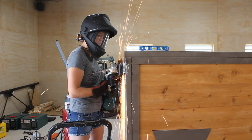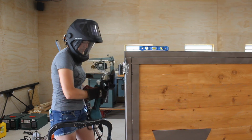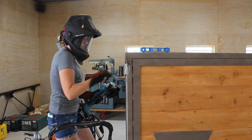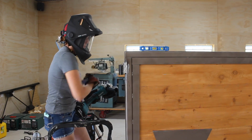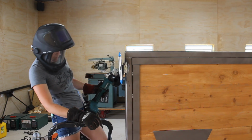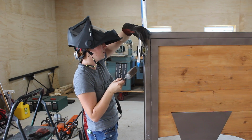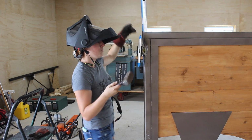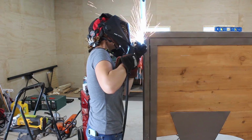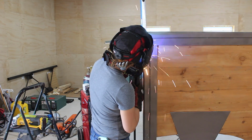Now to fix this problem, I was going to ground off the entire hinge, but Brian suggested cutting through the 2 welds holding the barrel on instead, or at least cutting through them enough to move it over into plumb. I thought this was a great idea, so I grabbed a cutoff wheel and started cutting through. Ta-da! After getting that welded back into place, we shifted the same operation down to the bottom.